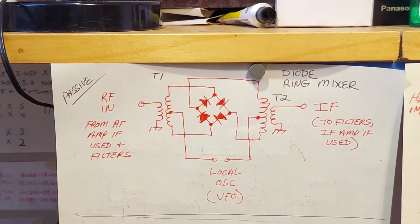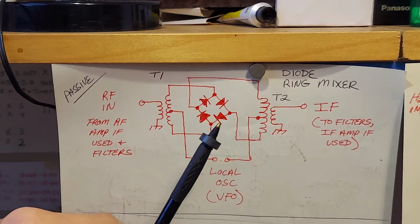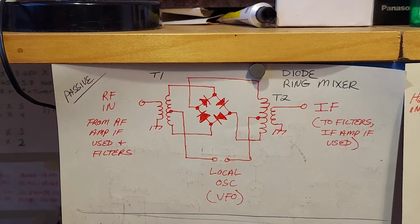I mentioned that you have 2. I incorrectly said in the last video that you have 2 toroidal transformers. Well, you do have 2 transformers. They can be toroidal, such as on this. There we go. This Amidon type FT40. What is it? It's an FT37-43 core. But another great way of winding your own transformers is to use a binocular core. If you can see that.